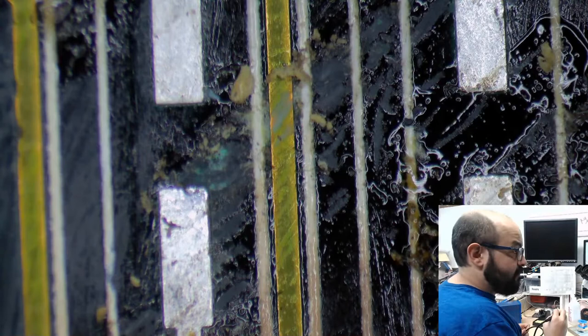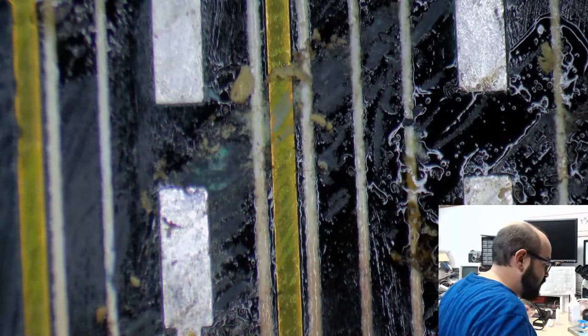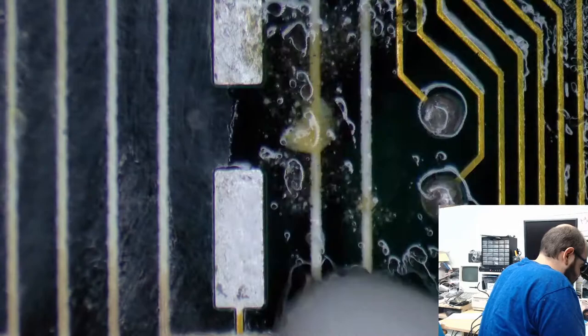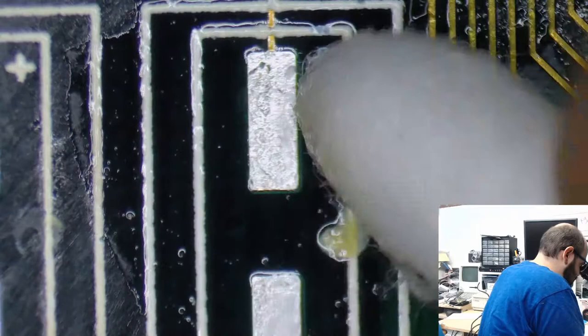Yeah, the yo-yo adapters, there were a few recalls for those because the wires were so thin. Those are the silver flying saucer looking adapters. They called them yo-yo adapters because they look like a yo-yo. The wire on the original revisions of those were quite thin, and of course they would get stressed and break, and people had problems with it. So when you did a replacement for those, I think they didn't send you a yo-yo adapter. I think they just sent you a PowerBook G3 adapter because those were less prone to issues, and I think those had a recall as well because the wire was probably too thin. I have to check out Jay's recall site to see if that's on record there.